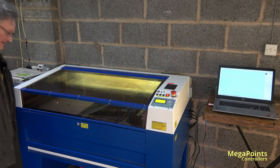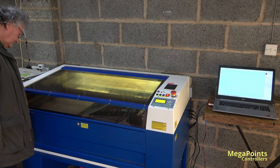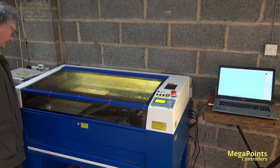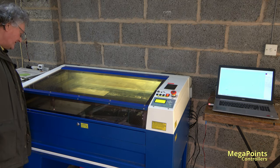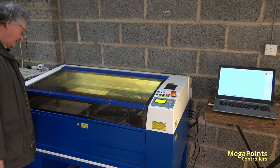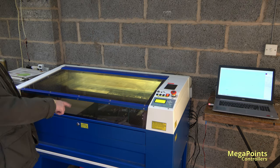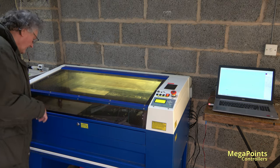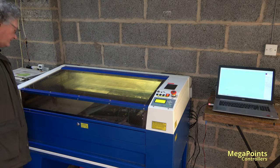Never gets old watching this. And I tend to do the MDF backing first, do the whole batch in one go. And then I've got actual size pieces for the fascias, which I can mark against. Now at the moment, the laser bed is set, so it's got the square, the honeycomb type grill, and the wood sitting on that, which is great for cutting. But what I'll do is I'll change the base.